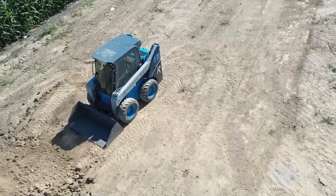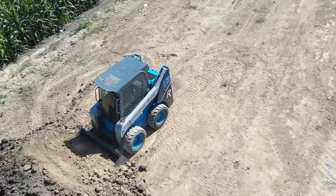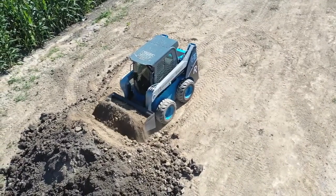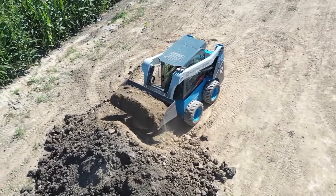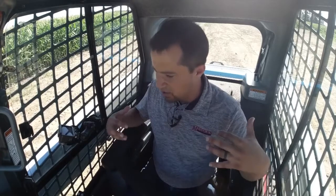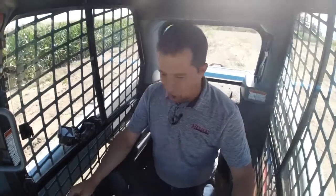And we said, hey, you can continue these concepts further and continue developing this machine with these new technologies on it, and say, when the boom is down at ground level, shut ride control off automatically, and when you come back up again, be able to turn it back on. And their ability to do some of that kind of stuff without introducing those drops that happen when the accumulator turns on is cool.